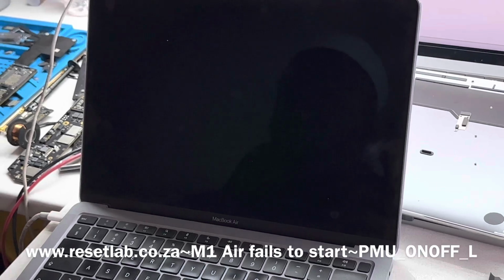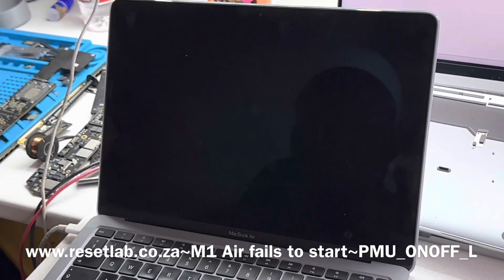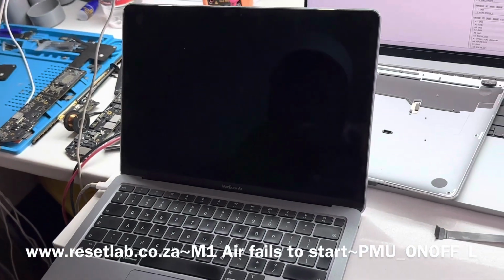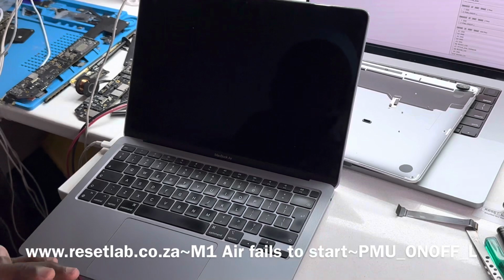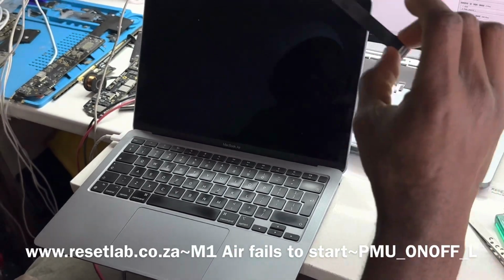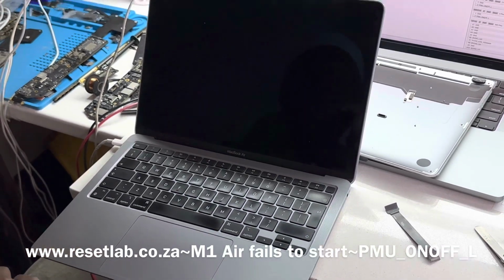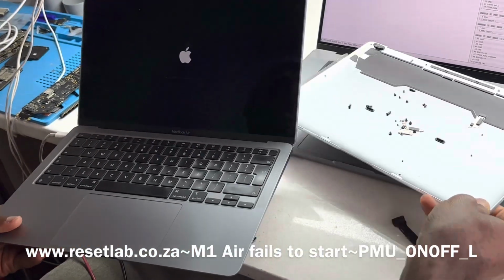We have feedback on the trackpad. Okay. So the couple of things we could do here. Behind door number one, we could disconnect the cable, the newly introduced cable. Disconnect it and see if it's going to behave still. We could put the device in DFU mode and revive it. Or we could go check out U4480, because it may be that it's not fully installed.